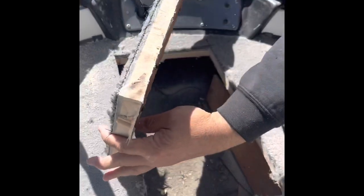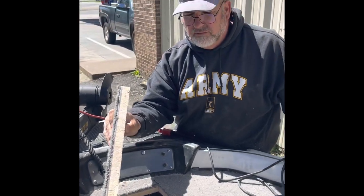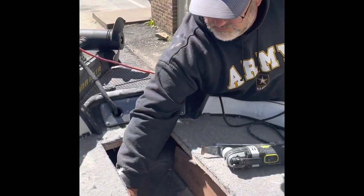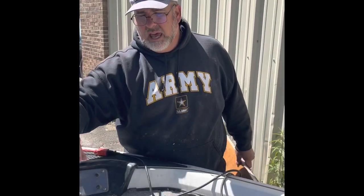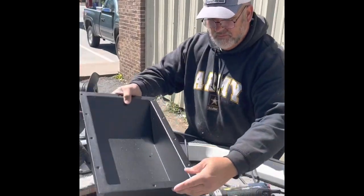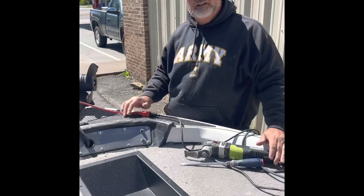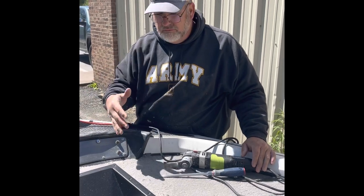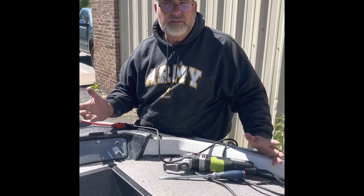There we go. You can see the thickness going on here — this is a solid chunk of fiberglass we just pulled out, so this is going to be a very sturdy front deck piece when we're all said and done. You can see there are boxes here and here, which actually helps provide a little bit of structure for the recessed pedal as it goes down in there. Let's go ahead and check it for fit. Recessed pedal — just like that. Now we'll go ahead and screw it down, clean it up, make sure the foot pedal fits down inside, and we'll have a happy customer.